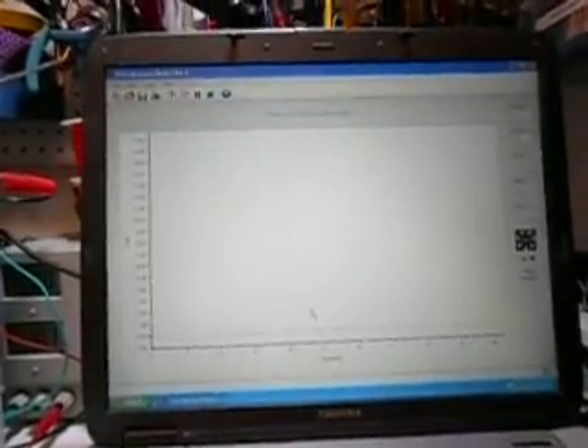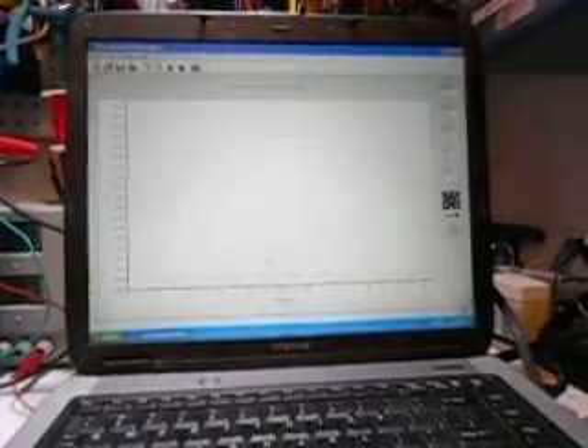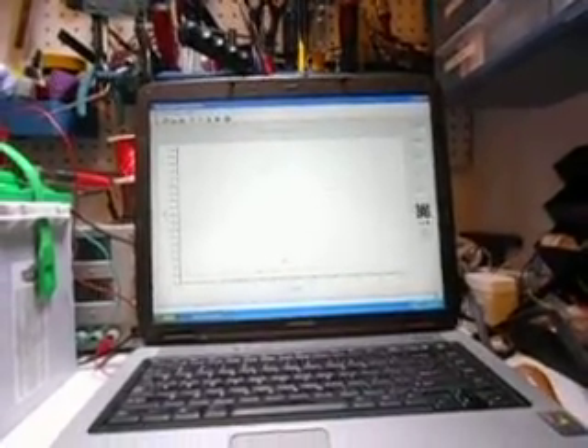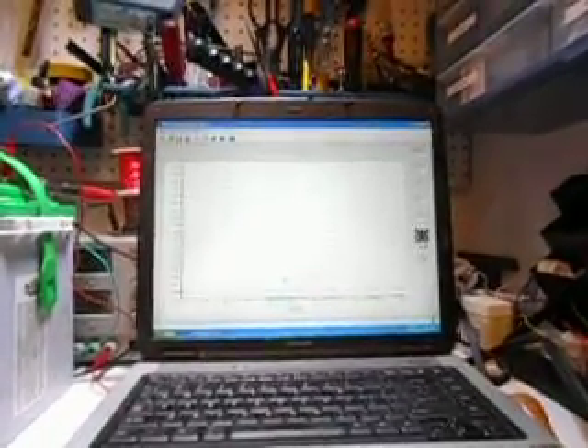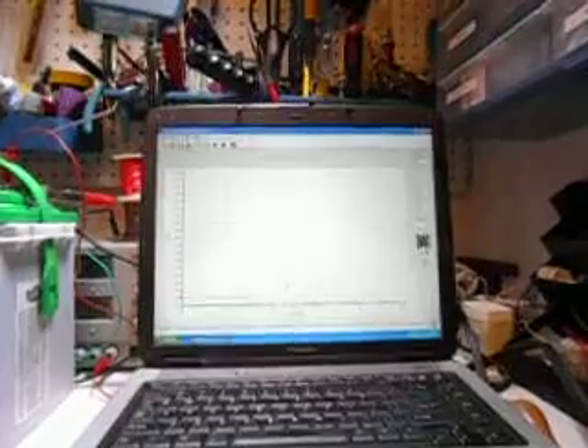The constant current charge on this battery will show up as a fairly flat, slowly climbing line — just very linear. It's up to 10.03 volts already; it's coming back up quickly now. Let's form those plates overnight, and in the morning I'll put it on the Bedini. Tomorrow night I'll re-download this and we'll see what's doing — see if we get any more capacity. I'm very, very excited about getting almost 30 ampere-hours out of this battery. Right now that's about 50% of what the full-blown lead-acid battery was when it was peaked out. This is K4ZEP, saying goodnight y'all.